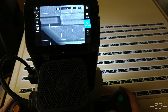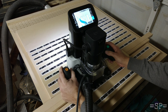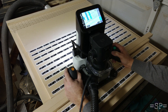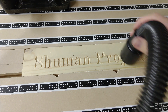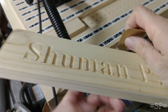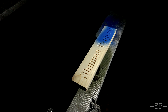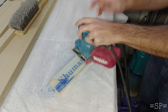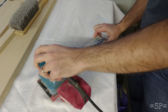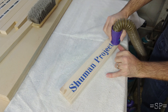Here's a test cut we're going to do — just a little piece of scrap and our little logo. I'm starting with a larger bit to rough out some of the interior of the letters, and then went back with a smaller bit to do a finishing pass around the outside. I forgot the main step of putting some clear coat down, especially on a soft wood like this pine. While the router did really well and the table did really well, my paint job was not terribly effective because the paint wicked up into the wood.